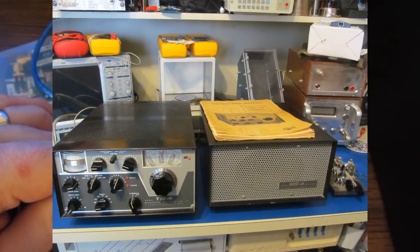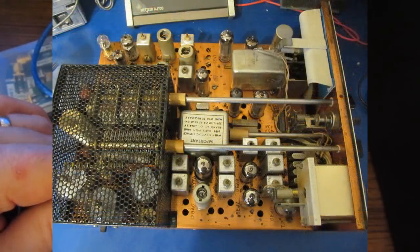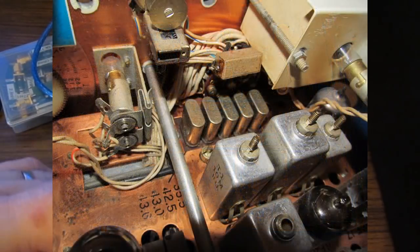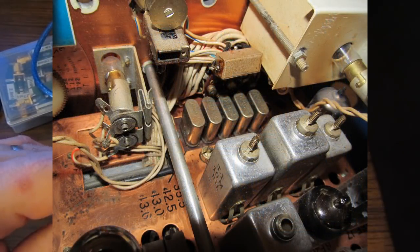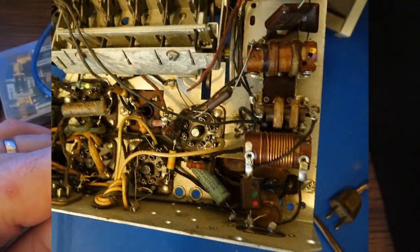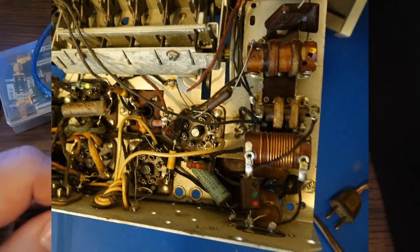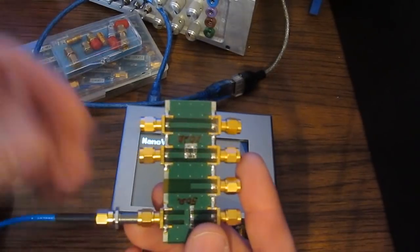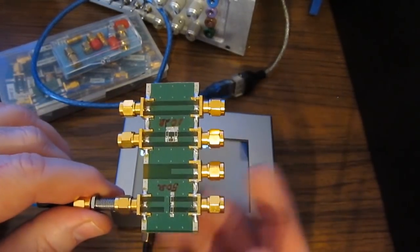All I'm saying is you can get away with a lot as you start working at lower frequencies like this. Anybody that's taken apart an old AM radio with tubes in it realizes that lead length, for example, isn't nearly as critical on a radio like that. As you start to look at FM radios, the layout becomes a little more critical, and at 400 megahertz it's going to be even more critical. Up to 1.5 gigs you can get away with something like this. Once you start pushing beyond that, I haven't had very good luck making homemade standards.